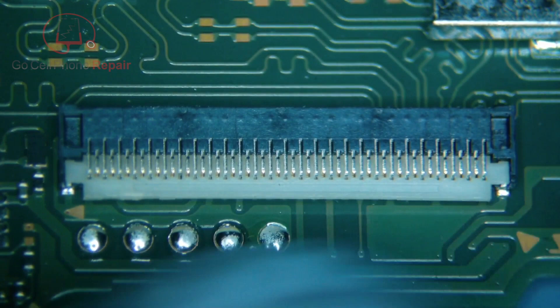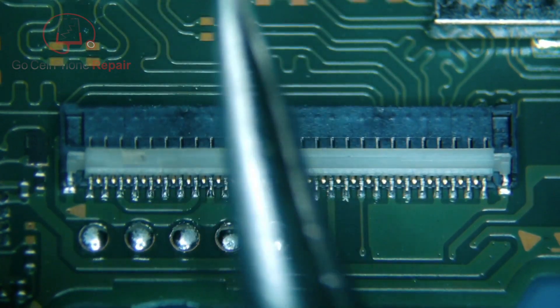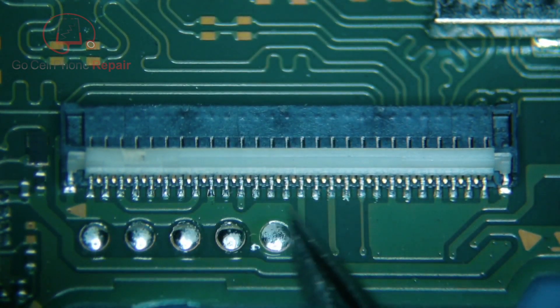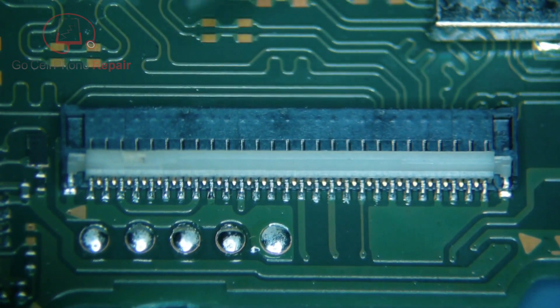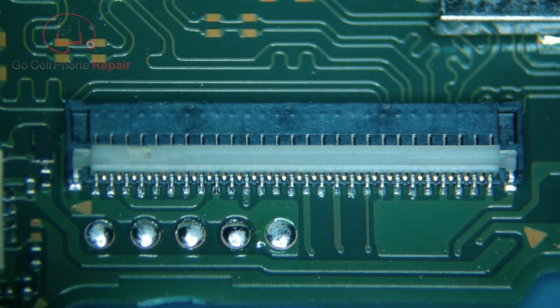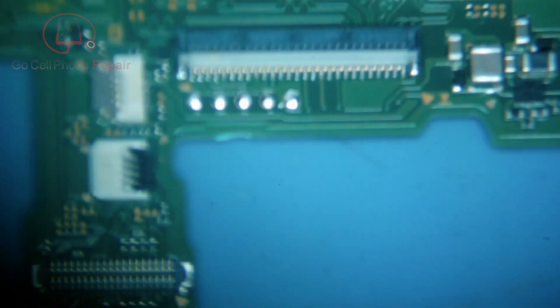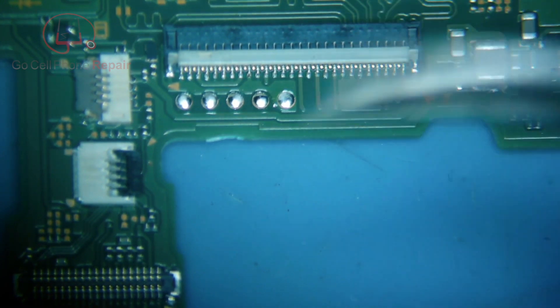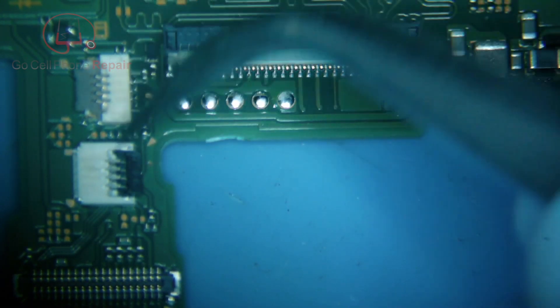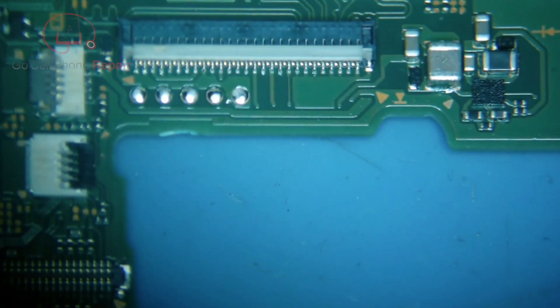And if we use a soldering iron, I'm thinking that we could probably go across here and desolder one of these off of a donor, but it doesn't look like it would be a lot of fun, so we're just going to go ahead and burn this one off. Fortunately, you can buy replacement pieces for this, so we've got some brand new connectors here that we will install with the iron. As far as removal, we're going with hot air, and I do want to insulate the surrounding components because these are very sensitive to heat - even the ambient heat from this area can make these things melt.